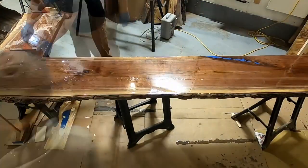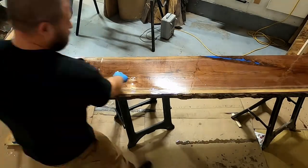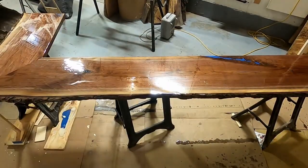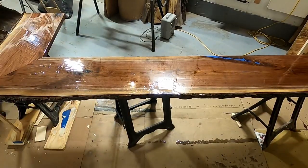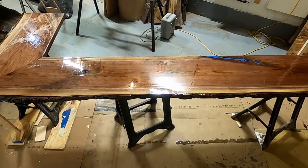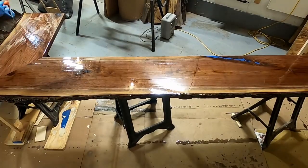In this particular project, because it's for a customer and I want a perfect layout, I'm going to do three seal coats to make sure I get all of those little voids filled with the epoxy. We're also dealing with the live edge that has bark on one side, so I want to make sure that I take my time and brush the epoxy into all those little nooks and crevices along the bark edge. I'm using a squeegee to move the material around, then coming along the front with a short two-inch paintbrush to rub that epoxy in. As the epoxy starts to self-level, it's going to go over the edges, so you have to constantly keep going back and forth, rubbing out the drips with the brush on both the bark side and the smooth side.